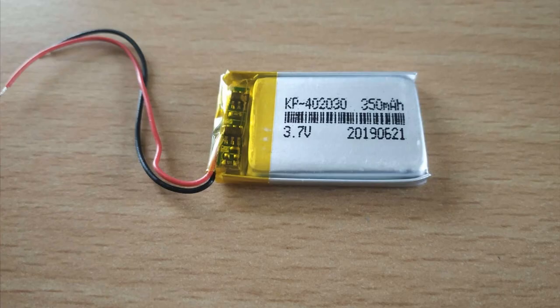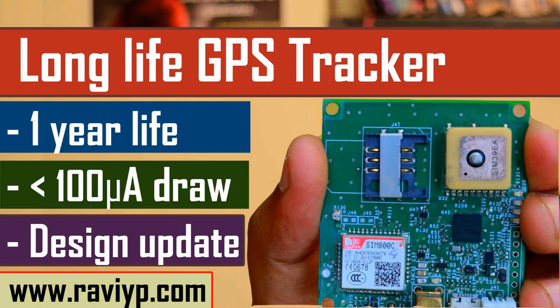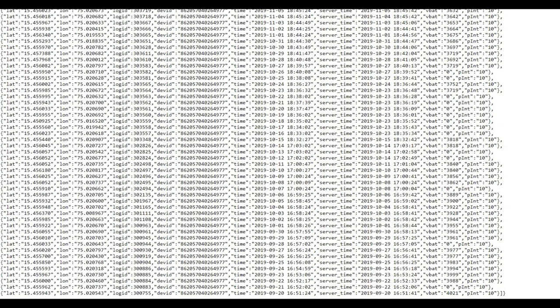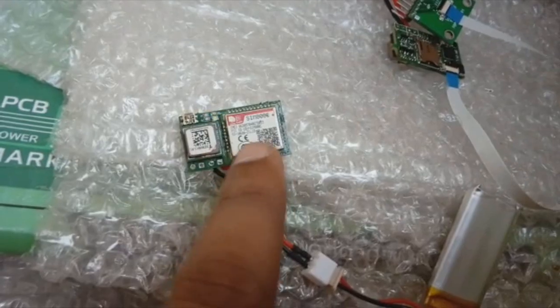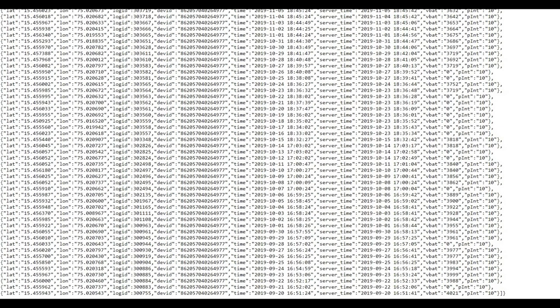We got a battery of the same size as the device, about 350 mAh capacity, and we ran some tests to find the power consumption for different applications so we can showcase to customers how long the device will last in various configurations. It can run all the configurations that V2 can run, like one ping per day by SMS or GPRS, hourly packets by SMS or GPRS, motion-triggered data sending, and continuous tracking mode. The first test we ran was at a one-hour ping rate and it lasted for approximately 48 to 49 hours.